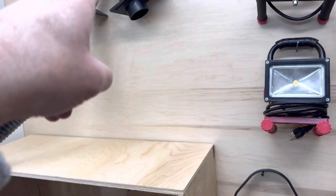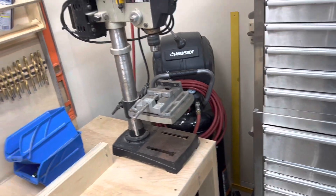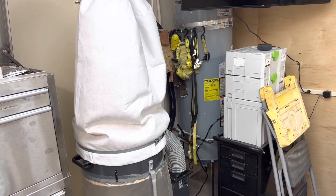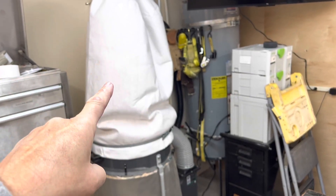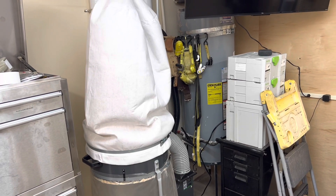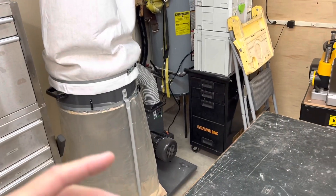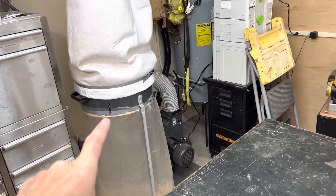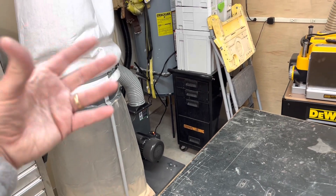I've got this out for an accessory tool and put down a spot for my drill press — I imagine that's where the drill press will live. I went out and got the Harbor Freight standard dust collection system that everybody has. The first time I ran it I was not satisfied at all with the fine dust coming out of the bag, so I've ordered the pleated filter. As everybody's videos explain, it's a huge advantage because you've got a lot more surface area — five or six times as much — so you'll move a lot more air through it, which will improve suction and reduce the fine dust. At some point I'll probably put the motor on the wall, have a collection bin, and use a cyclone.